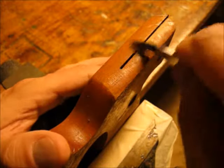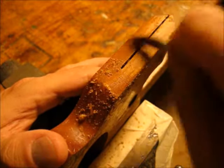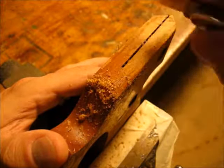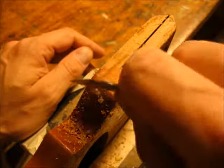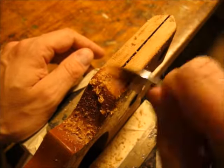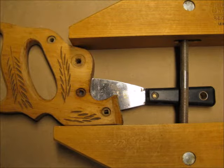Rather than use a chemical stripper I just like to use my pocket knife and scrape off the varnish. To me this is less messy and there's no bad fumes. And here I have glued and clamped that small split I found at the one fastener hole.